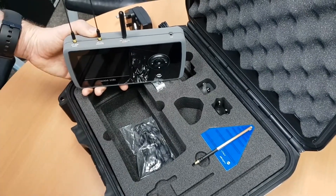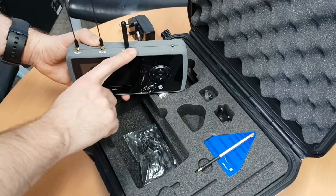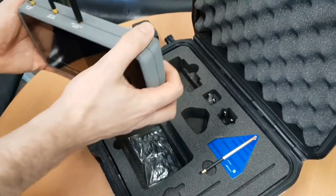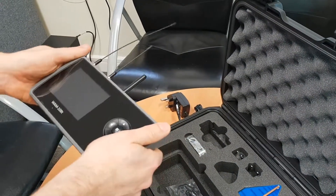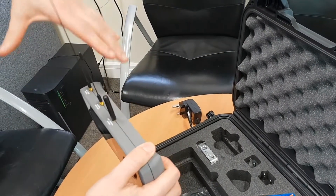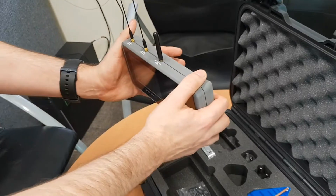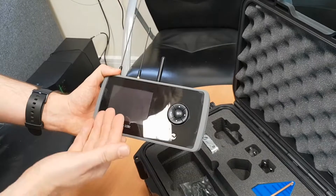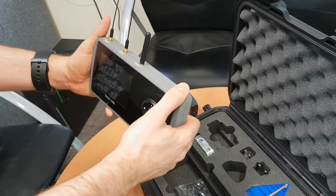The directional antenna can be used in any port. With an omnidirectional antenna, it picks up frequencies from all around — if you're in a room picking up a frequency, you can't tell where it's coming from. Pointing the unit towards or away from the source makes no difference. The only way to locate it is to walk towards or away from it, watching the display to see the signal getting stronger or weaker.